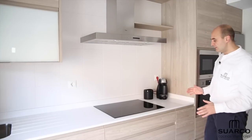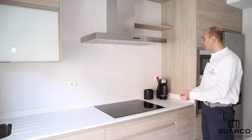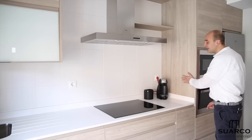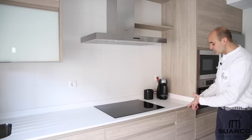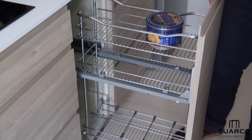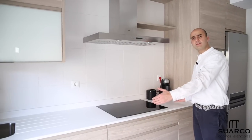After the column zone we reach the work surface. First important detail: we centered the hob to leave working space on both sides. In this case the coffee maker is here — we left 35 centimeters of separation from the oven column so cooking grease doesn't splatter. And what did we do with these 35 centimeters? A pull-out bottle rack with three height levels for all types of bottles, full extension with soft-close.